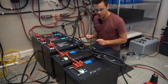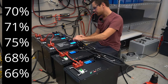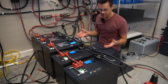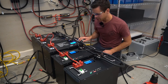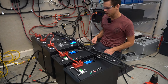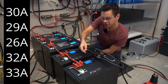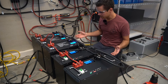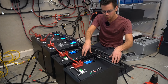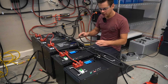We've been running 200 amps for about 30 minutes and now we're checking the state of charge. Battery one is 70%, two is 71%, three is 75%, four is 68%, and five is 66% — overall they're not that far apart. Considering how much current was flowing out initially, a lot of them have settled down. I think it's because we're hitting that flat part of the discharge curve. Now checking current: 30, 29, 26, 32, and 33 amps — the difference is not as great anymore. In the beginning there was a larger voltage differential, especially with some batteries freshly charged, but now they're nearly all the same.